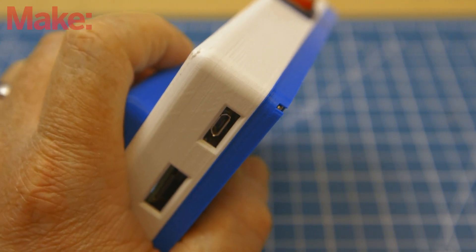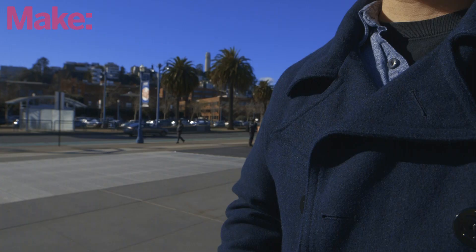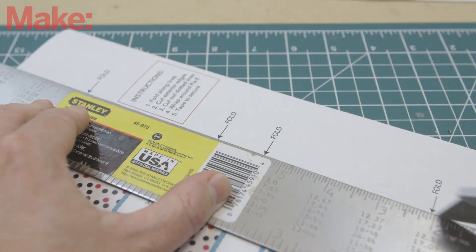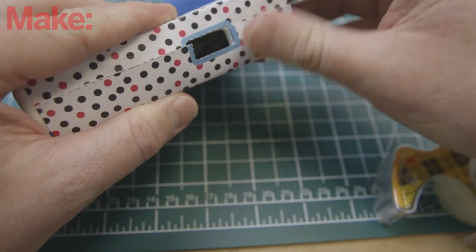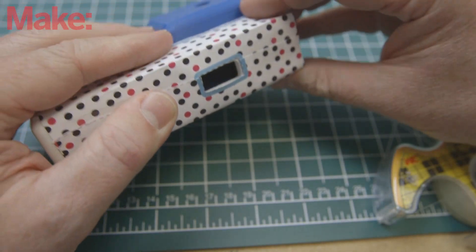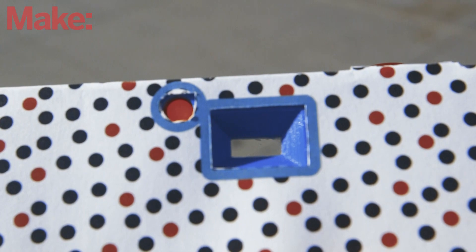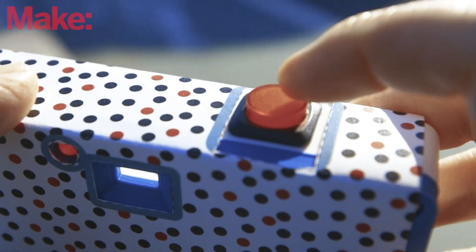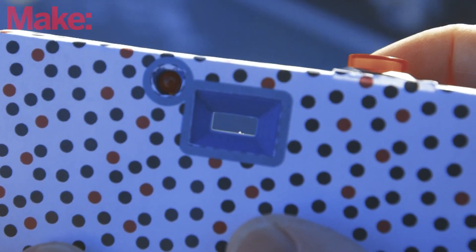Go and have fun! Your Pixi GIF camera charges up quickly through the Adafruit PowerBoost micro USB port on the left side of the camera. On a full charge, it should last about 7 hours of continuous usage. For an extra bit of flair, print out one of the colorful sleeves and seal it around the camera using some double-sided tape. To use the camera: switch it on using the big rocker switch, wait for the red status LED to begin blinking on the back of the camera, aim at your subject, and hold the top button down to begin filming. The blinking LED will turn solid for 4 seconds and then shut off. When the LED starts blinking again, it's ready for the next GIF.